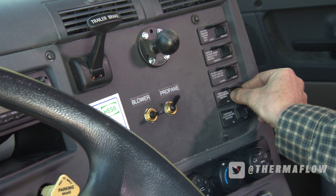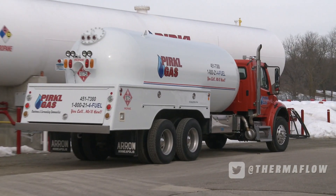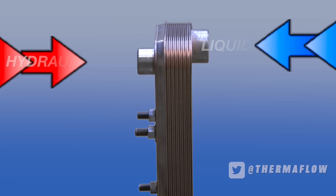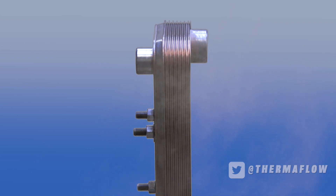Where the 500P came in — it's a really genius piece of equipment — is that it takes the inefficiencies of both propane and the inefficiencies in a hydraulic pump drive system. We're taking propane and putting it through a heat exchanger that has two circuits: one has propane flowing through it, the other has hydraulic fluid. The hydraulic fluid has heat in it from going through the pump and the motor and comes back warm. We take that liquid propane coming off the pump and put those two together through several plates, exchange that heat, the liquid propane flashes, becomes vapor, and vapor pressure is restored back up inside the tank. So it essentially tricks it into thinking that we have a vapor hose connected.